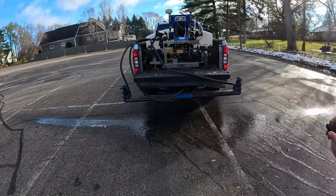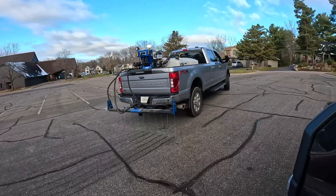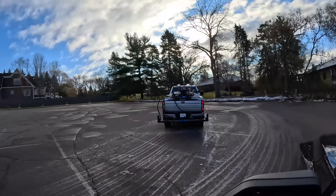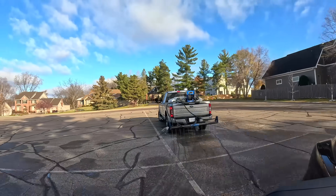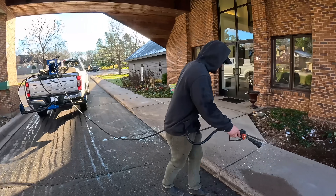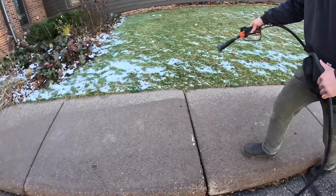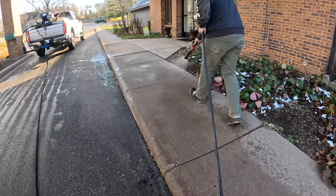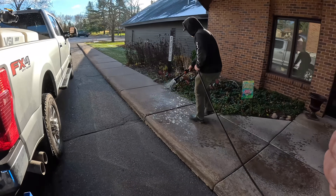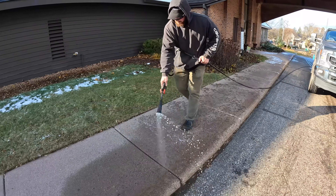Everything's working. All right, now I can switch it to auto and run it. Alex just demonstrated the ability to control the left, right, or center boom independently, and this also tracks how much material you put down — which is absolutely huge to protect yourself against slip and fall claims. As he speeds up or slows down, you'll notice the volume of material coming out will change to match his rate of speed. The main difference between brine and rock salt is the amount of material you apply and how effective it is. By taking rock salt and putting it into a liquid solution, you are creating brine, and that spreads much further than just laying a rock salt granule down. You're forcing the chemical reaction, which means you're using less material and getting it applied right where you want it.